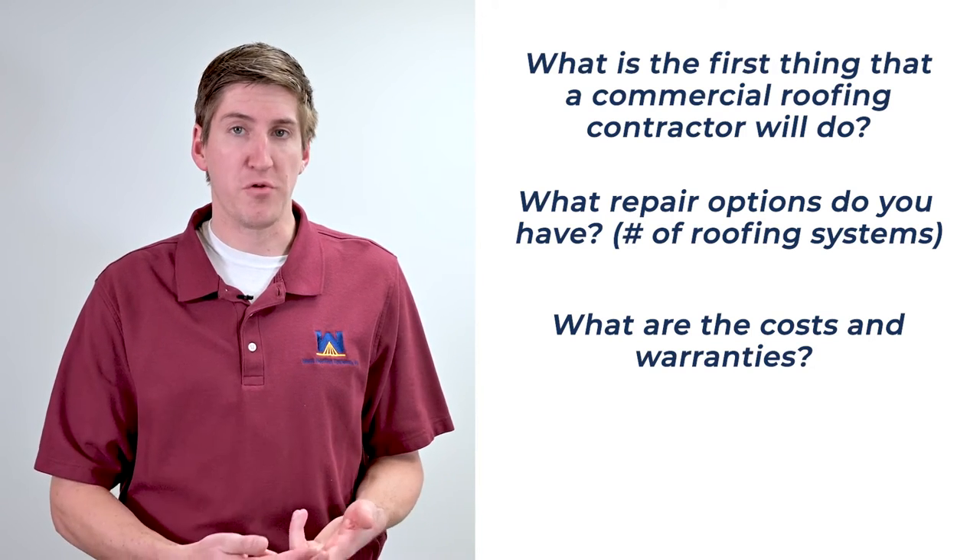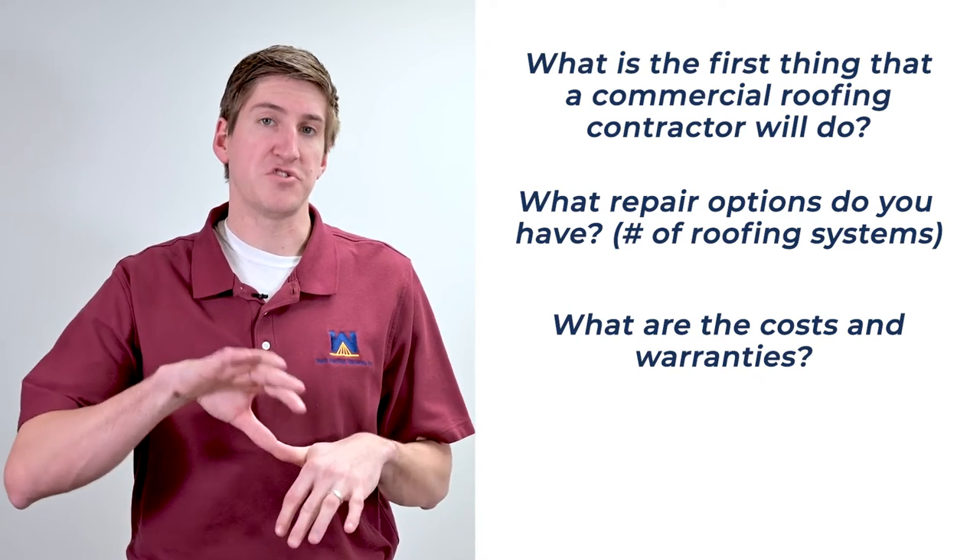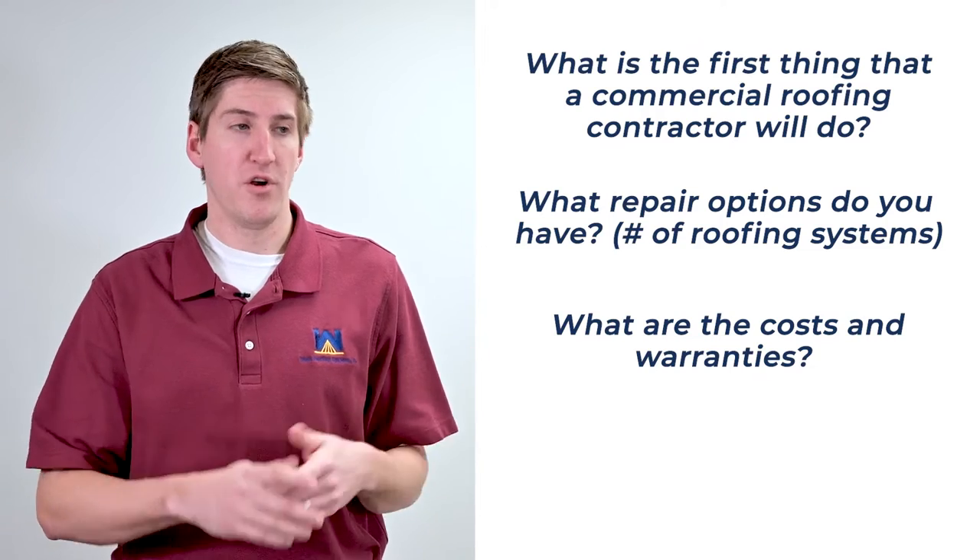You can spray foam the roof if you want to make some changes in your sloping to avoid ponding water, or you want to add some R-value, or you want a renewable roof. You might lean towards spray foam, or you can lean towards a coating system as well. The coating system is $2 to $4 a square foot — certainly prices have gone up with today's shortages. A foam roof is $4 to $6 a square foot, and same with all the single-plys — TPO and EPDM are usually around $4 to $6 a square foot.